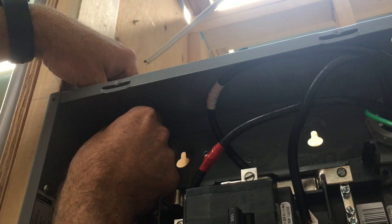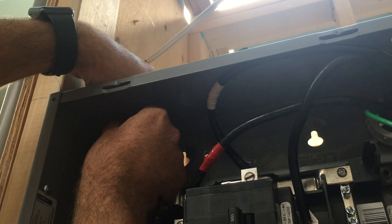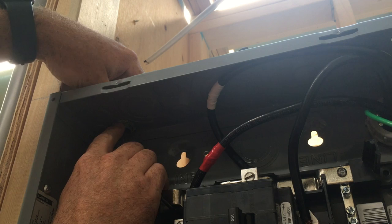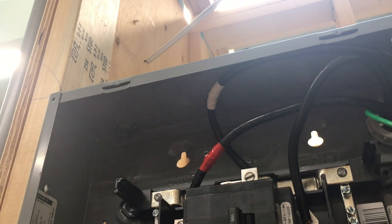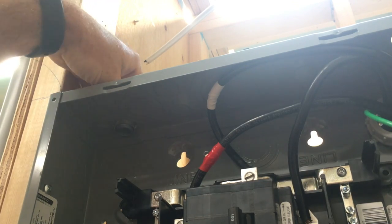Once this is in there, we want to make sure that the top is straightforward so you can tighten the Romex up when it's ready. They make a tool that will actually tighten this in for you. Most electricians will carry a screwdriver they're not a big fan of — put the flathead right there, give it a couple knocks, make sure the top doesn't twist, and it's in there. It's totally personal preference if you want to carry an extra tool for that.